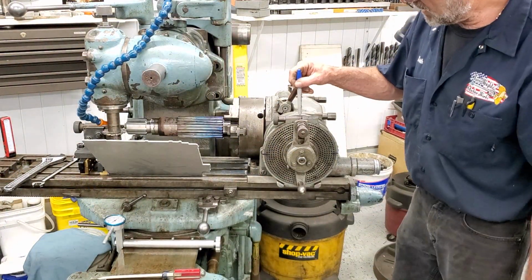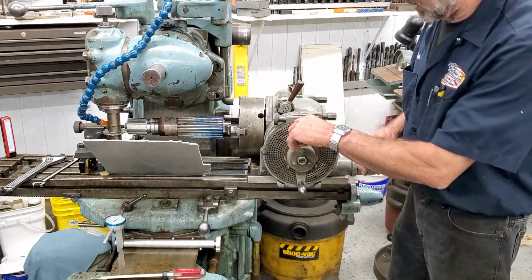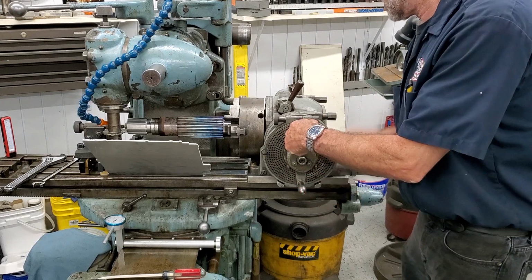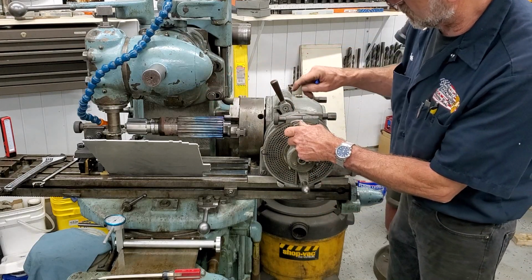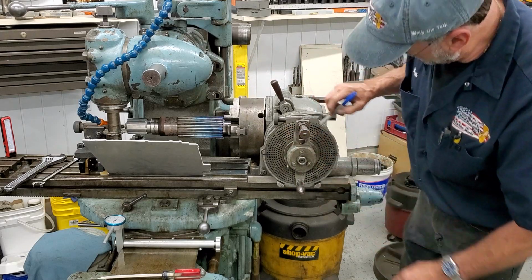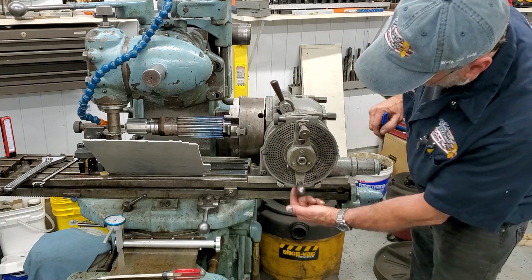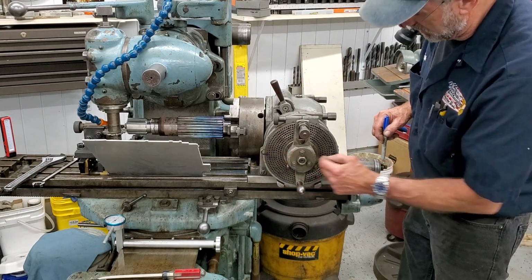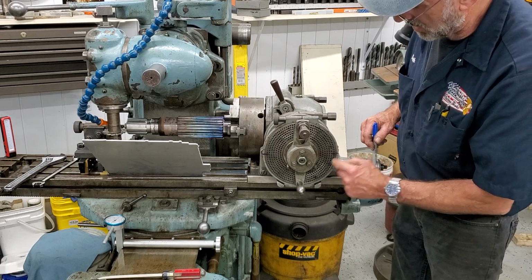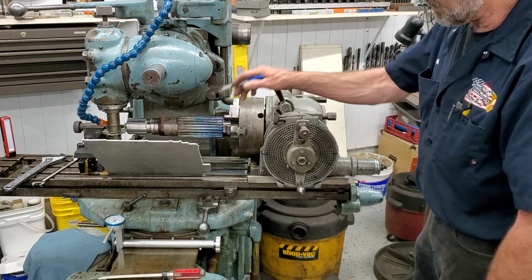Okay, we've been running the first pin up here and a pin 180 over here, and we've been switching this out and rotating it like that much to that much to make a whole tooth. So what we've done is we've counted out the holes, 25 this way and 25 this way, or 25 from here to there or here to there. It's equal. So these two marked holes right here are 25 and 25, which will be halfway between there.